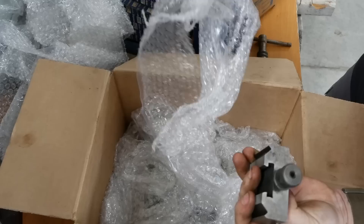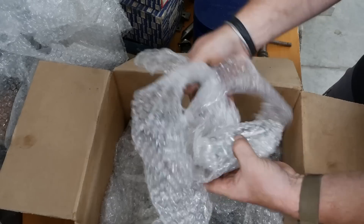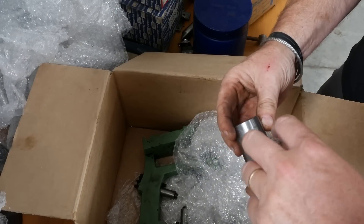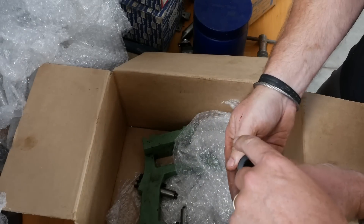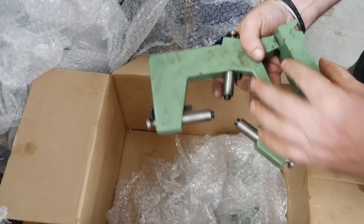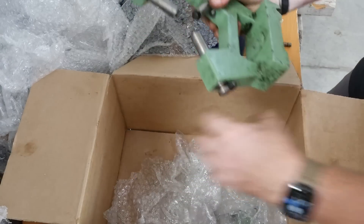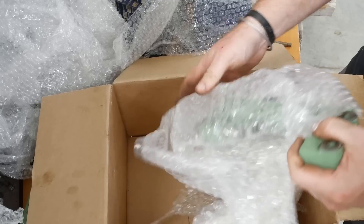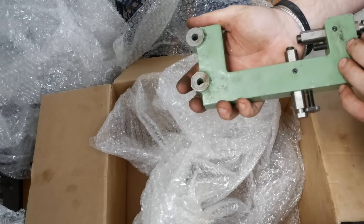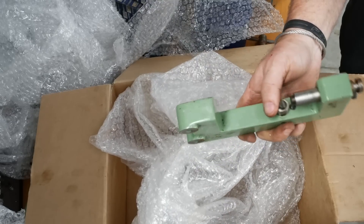My ball turning attachment. You appreciate he's really looked after his gear - there's almost no rust or anything. It's certainly nice to take on a tool that's been looked after knowing you're going to look after it in the future. That's the adapter sleeve - they quite often have like Morse four and a half down to Morse three, or maybe Morse five to three. They quite often have that weird four and a half size. There's the traveling steady - looks like the original one, barely used. That'll bolt onto the front or back of the cross slide for stopping long skinny bits from bending out of the way. Interesting that all the stuff's that green color - it's all RAL 6011.